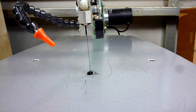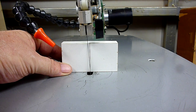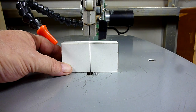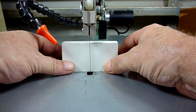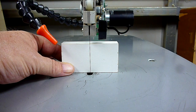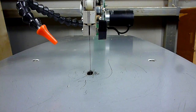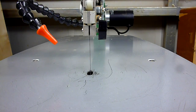That's good tension — that's the way it should sound on your saw. To get our blade set up square, I'm going to use the same block I used when setting the drill press up. I turn my knob, or if you have a different style saw, adjust your table until the blade fits into the groove, lock it down, and now you know your blade is perfectly 90 degrees to the table. This is extremely important, especially with thicker wood — even being off a quarter of a degree will exaggerate and your cut will come out crooked.